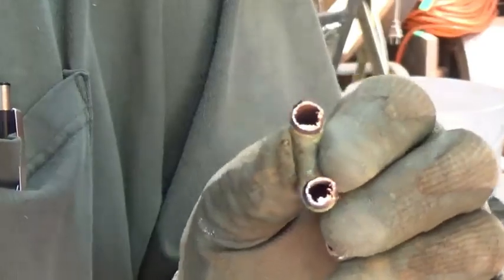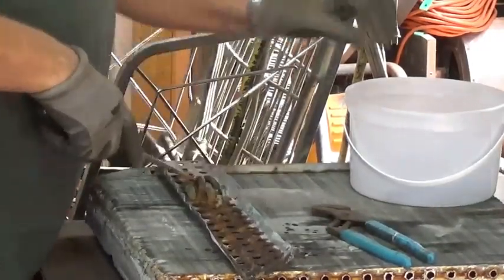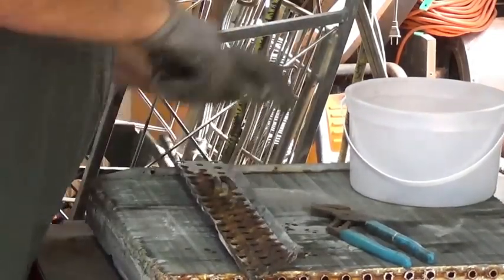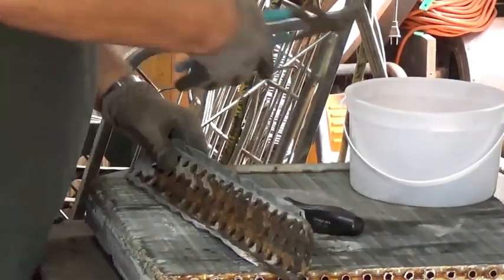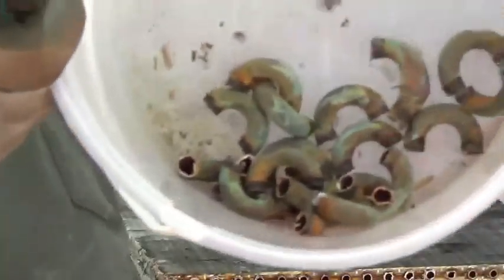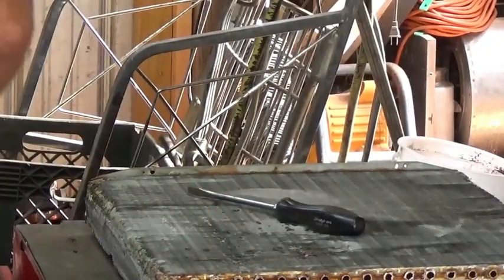you can see how rough that looks. Yeah, so the finer the blade, the better. The smoother that cut is, the easier it's going to pull through the holes. Might cut a little slower that way, but sometimes they can be a battle trying to pull them out. So now we got clean number 2 copper there. Just that little bit. There's a whole lot more that's laying on the floor, but I'll pick them up off camera.